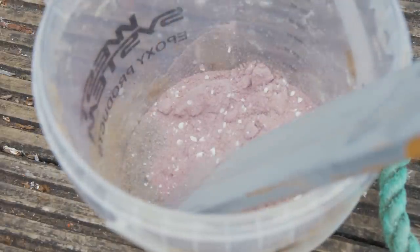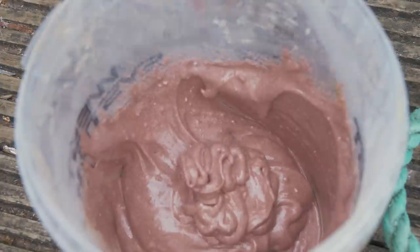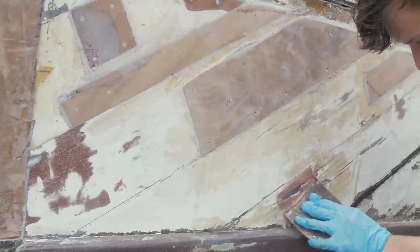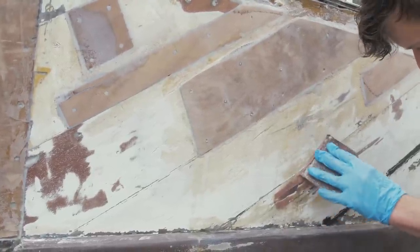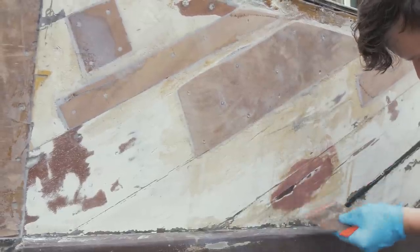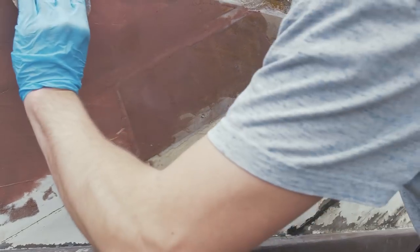So I'm mixing in low density filler here with the epoxy, the West Systems epoxy. I'm not sponsored by West Systems, but you can see I'm using their product a lot in these episodes. I used to use different things like car fillers. I tried my hand at that. That stuff is horrible in my honest opinion, using auto body filler. A lot of people use it and swear by it too, but I find that if you put that against the wood, filling gaps, screw holes, things like that, if moisture gets in behind it, it's just not going to do its job.